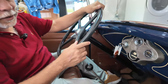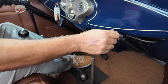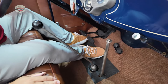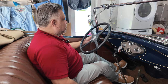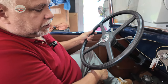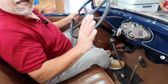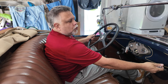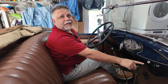There's a handshake to this as well — it starts by putting the key in. It's very similar to the tractor. You turn it on, come down here, and turn on your fuel. If it's been off and it's cold, you take the carburetor and turn it about three-quarters of a turn. Make sure you're in neutral — same as the tractor. You're going to retard your spark all the way. This is the accelerator, as well as the pedal down here. You're going to move this slowly until she starts. And here we go with the starter. Oh, I forgot to pull the choke — you had to pull the choke out a little bit.